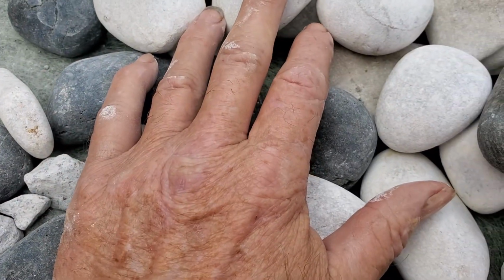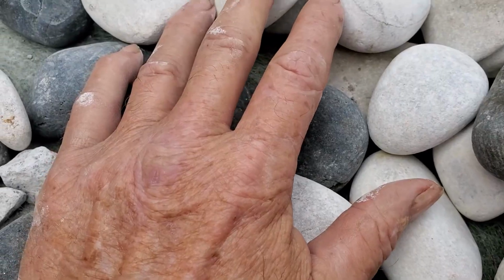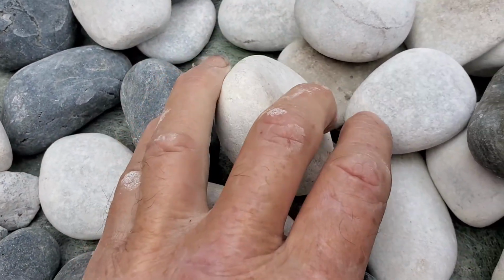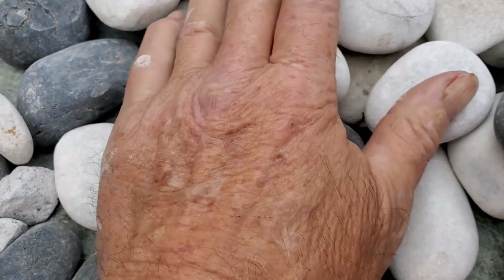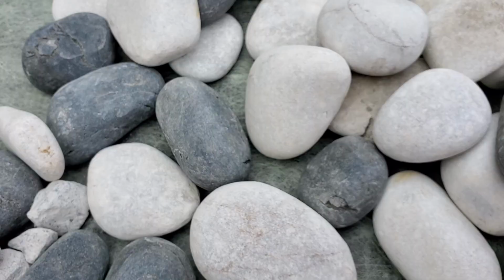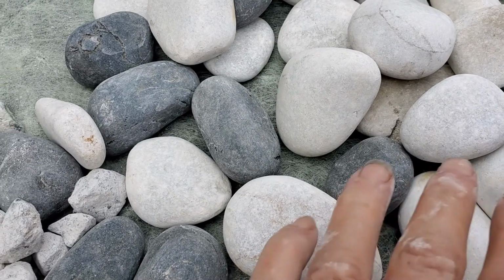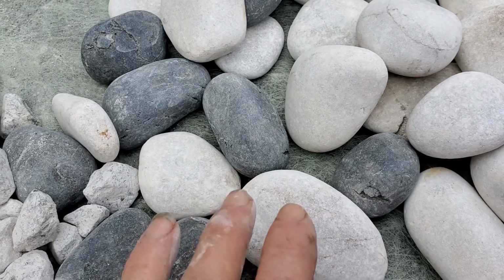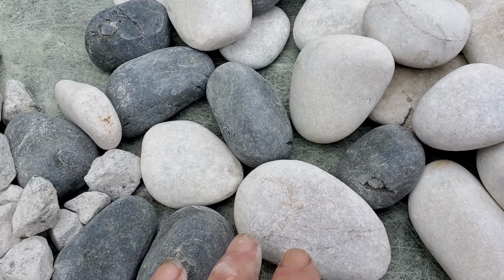As this moves around, whether it's wrapped or not, there is growth inside of these stones. And because they don't compact, they slide around. Can you see that? They slide around, even with the lawn tractor. The lawn tractor passes over this area, these stones move, and that causes problems in your French drain.